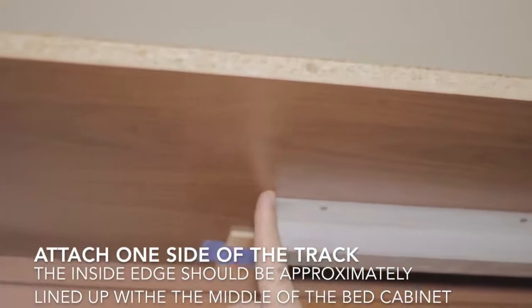When you put the other end of that sliding bookcase on, you'll need to use a stubby screwdriver to tighten the cams on the valance and the toe kick. You'll reinforce this with inch-and-three-quarter screws through the back into the deck, top, and horizontal partition. This is very important — do not skip this step, as it adds the strength required for these bookcases to hang and support whatever you're going to put on them. Additionally, you will add L brackets just inside the roller post holes and use three-quarter-inch screws to secure those in place nice and tight. This is a very important step to reinforce these bookcases.